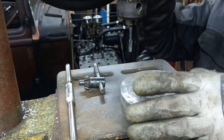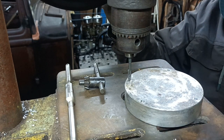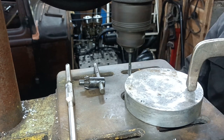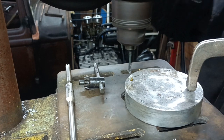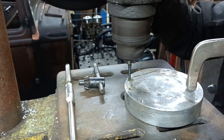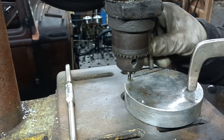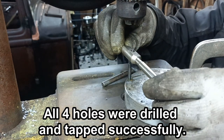If you're ever tapping, you must make sure that you haven't got the depth stops engaged on your drill so that the tap can pull the drill down. Do you know what I mean? Pull the quill down is what I mean, I suppose. Okay. Let's put a bit of a roll on it. Let's go for it. Got my hand on the off switch. Okay. I went a bit further that time. So it should just be a case of unwinding it now.